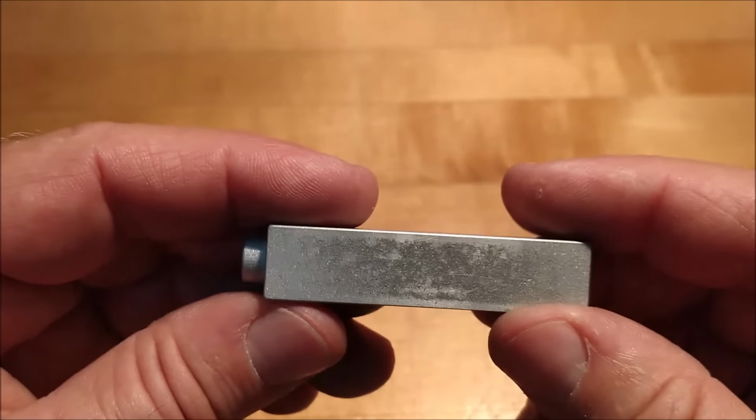The only thing that I will have to deburr by hand is the very top of the slot on the inside. You can see the little furry line reflecting the light just below the chamfer. See it? My guess is both sides. Yes, sir, both sides. That is from when I raised the tool 5 thou and took the additional cut. And I'm sure that's a very superficial burr. I will stick a piece of 220 emery in there at a diagonal and wipe it down. And I'll also try to get all these little burrs out on the end that are kicked out from the rotation of the cutter.